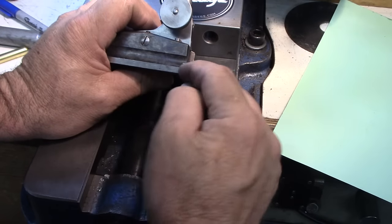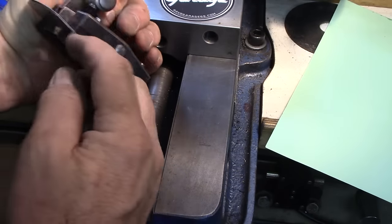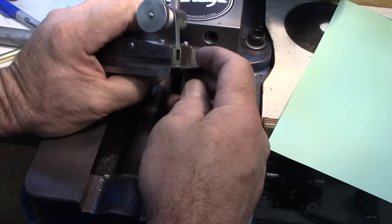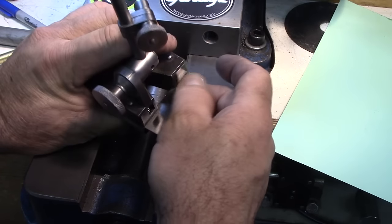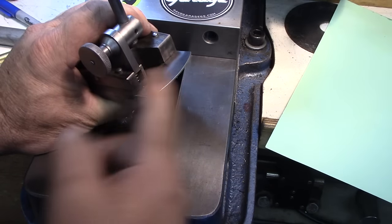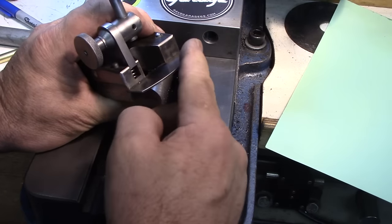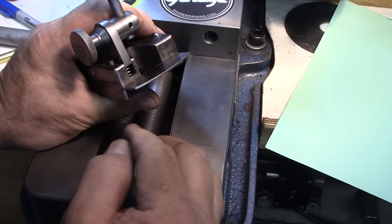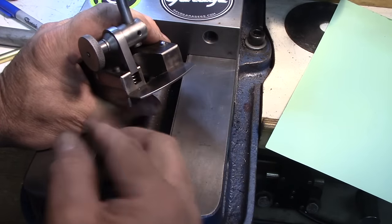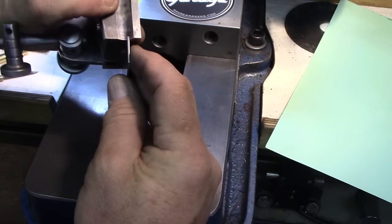This is hardened and cut in that groove, right? This here is about 62 thousandths thick stainless piece of sheet metal. And then after I put it in, I just pounded it in tight, and then I sanded that to a nice radius. It doesn't matter what the radius is, just as long as it's a curve and smooth. It went in there real nice and worked out really well.